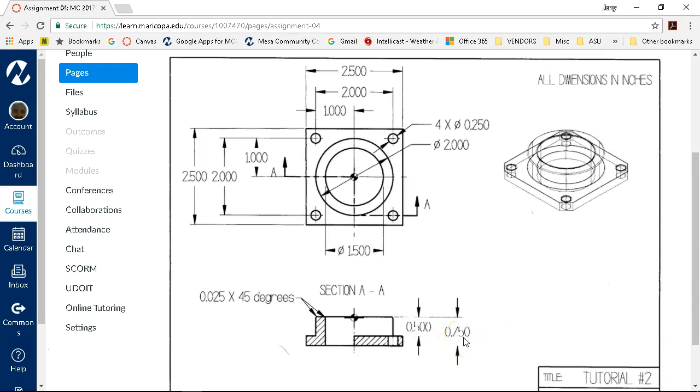Looking at the sizing, 0.75, we've been doing a lot of our parts with oversized material. We can stay with that. I don't really have much in the way of a fixture to do this part any better. So 1-inch material. If we do go with the saw cut, 2.5 by 2.5, a little bit oversized, or with stock material, maybe 10 to 15 thousandths oversized, and then we would saw cut a little bit more on the length.